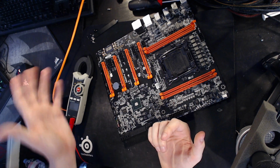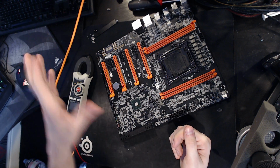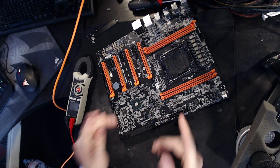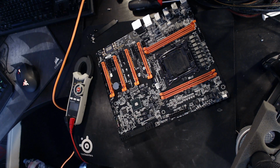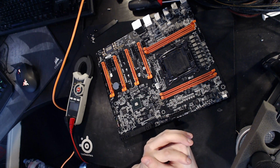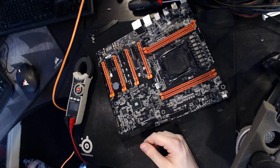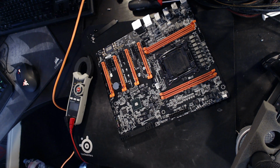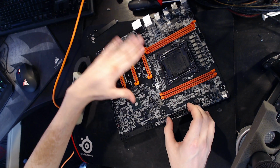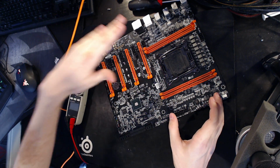CPUs. Though on Broadwell-E, I'm not aware that the OC socket does anything. I think Intel decided to disable it at that point. But at least on Haswell-E, those unused lands, if you fed them extra voltages, you could get much, much better uncore overclocking, which is why when X99 first came out, Asus was just killing it with the overclocking. They were massacring everybody else because it was just a case of, we have 4.5 gigahertz uncore and everybody else is stuck at 3.7 gigahertz.